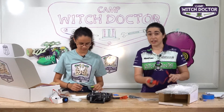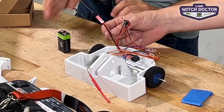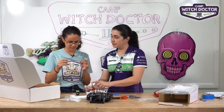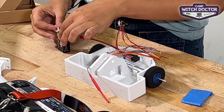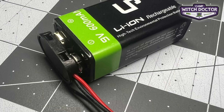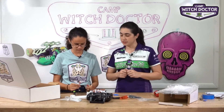Now we're going to go ahead and connect this battery. We have the red and black leads here with this connector. Go ahead and find the battery lead that should match this connector — it'll be the opposite side. The side with the connector that looks like the battery you're going to press onto the battery itself. If this turns out to be hard, don't force it too much — if you force it it might bend the little contacts and you'll have to bend them back. Just pay attention to what you're doing and press it in straight.